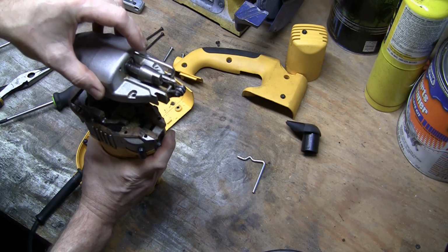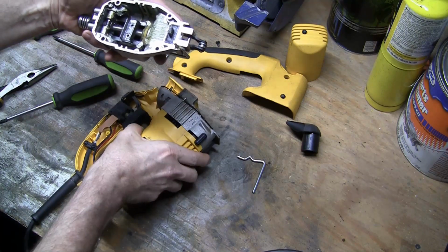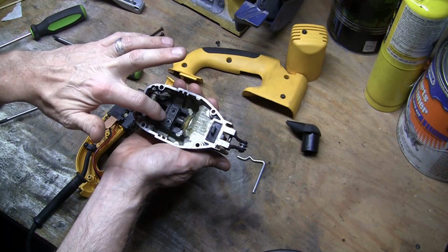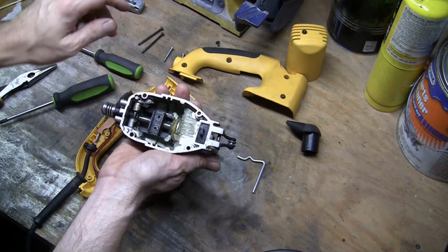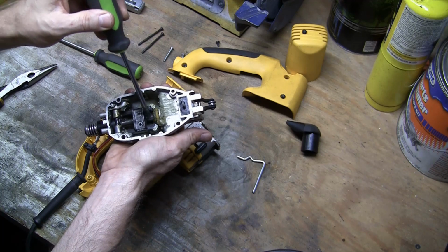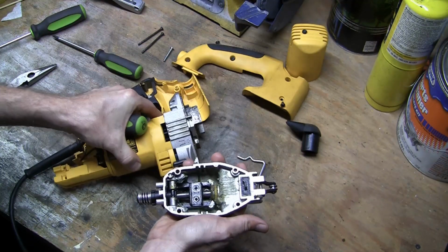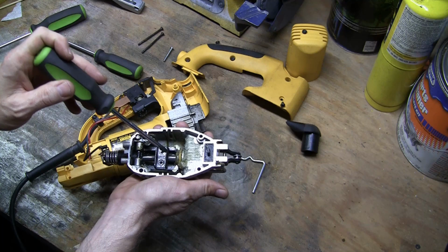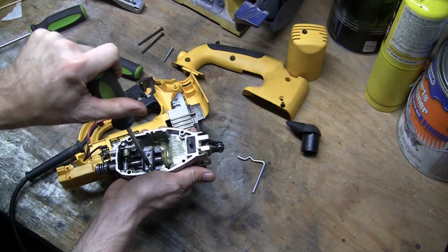And try not to move anything at this point, or else you're going to have to realign this bracket with the wheel there. But the repair for me, anyway, these 2 screws right here, one of them had loosened up significantly. You can actually probably tell this one looks a little worn off. So it's just a matter of coming in here. There is a flat, I should point that out. This is all round on either side, and there's a flat right here, so when that wheel is seated and moving around, sliding back and forth, it doesn't get hung up. So make sure this bracket, because when it's loose it'll slide up and down the shaft, is centered over the flat, and then you can just make sure these are still tight.